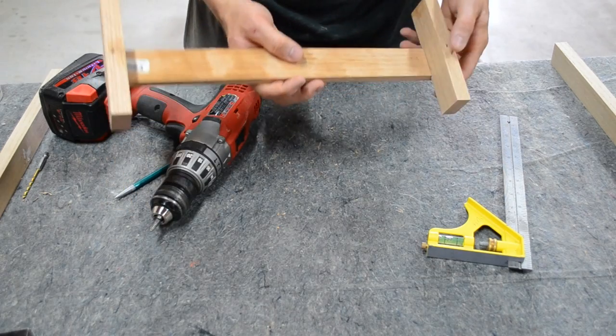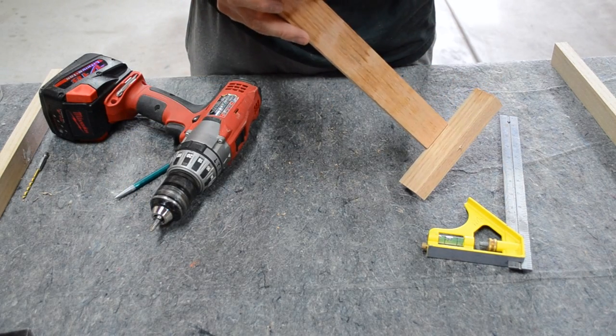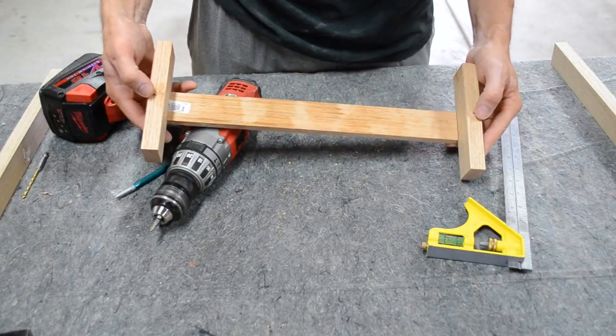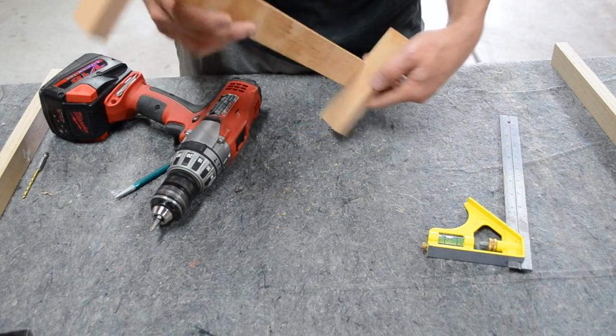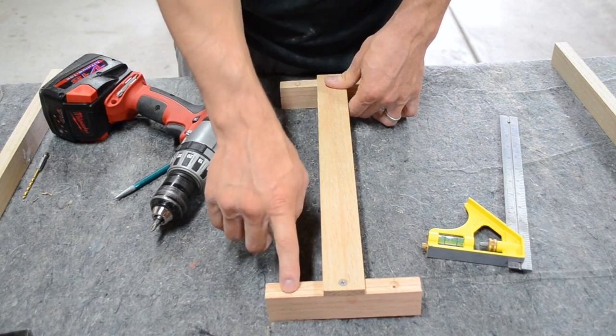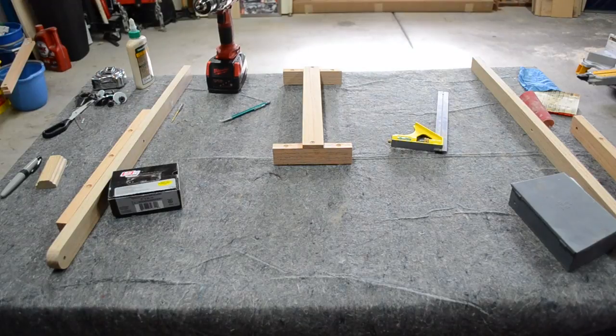Don't be surprised if you're using two-inch screws — it's going to pop out just a little bit. The reason I do this is because I actually want to leave a mark. It helps me when placing it down onto the top piece while I'm screwing these in. Now that you have your center section done and your legs are still drying, the last thing to do is give each piece a really good sanding. I'll sand each individual piece and then when I put them back together, I'll give them another sanding to make sure everything is even and matches size-wise in case anything was a little off.